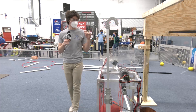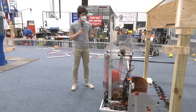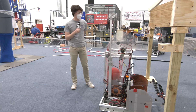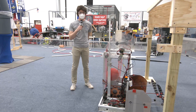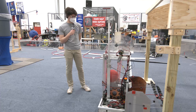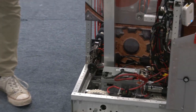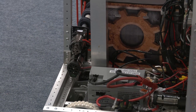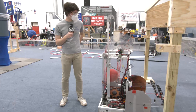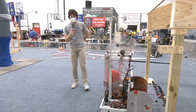We decided on the mid-rung because we felt like it was enough of a challenge to package everything and get it all sorted out, and we wanted that extra point boost. We felt that since we wouldn't have to go from rung to rung climbing those monkey bars, this would be just enough of a challenge. We have a Falcon 500 motor at the bottom on our winch, running on a 16 to 1 gear ratio. We chose the Falcon 500 since it had a high torque value that we'd need for this climb and would ultimately hold us up pretty well.